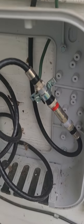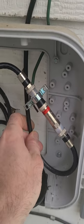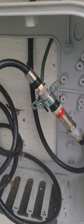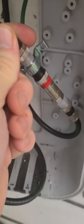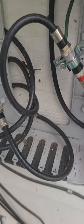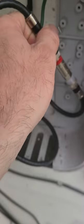What you want to do is check this wire right here — this is my service drop wire. I know that because it runs up the house all the way out to the pole outside. That's where your signal's coming in at. This other wire right here goes down and around into my house to where my modem is located. If you didn't know which wire it was, you'd hook one wire straight to this one.